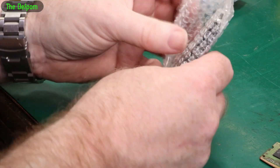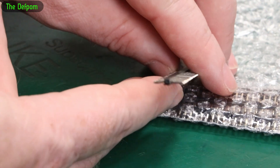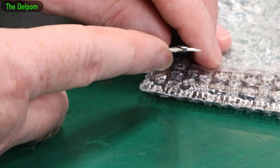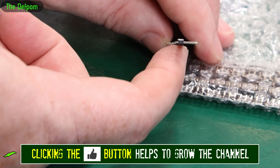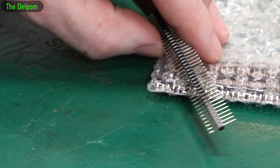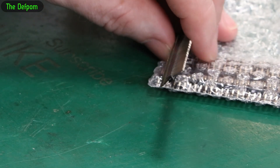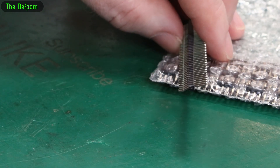More headers. These ones are like an offset, so you can flush mount them. If you want to surface mount these, you can do that — the block part will sit on the PCB and can be mounted to a pad, giving you an end connector. I didn't have anything like this before, and I've used things like this before but not very successfully because I had to tip them onto the board. I thought I'd get some of these.